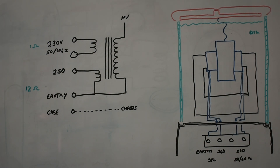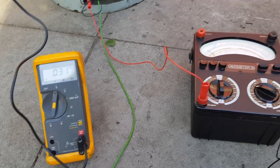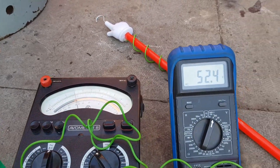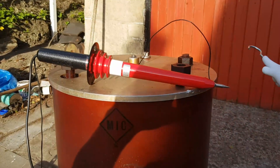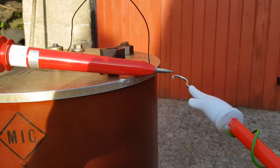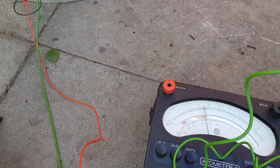Resistances are showing as very low for some reason. So I've got a high voltage probe — the yellow Fluke meter is on kilovolts, and the EVO is giving me current on the primary. It's 3 amps at the primary — that's only 53 volts, 52 volts — and we've got 2.2 kV sitting here. It makes a slight difference to the current but not a lot. The short circuit takes it only to about 2.3 kV.